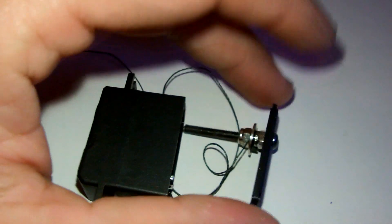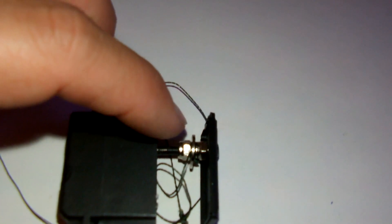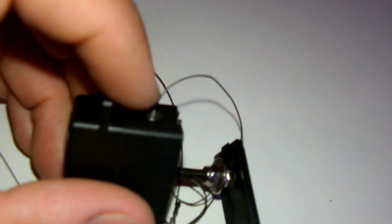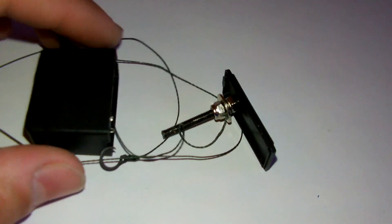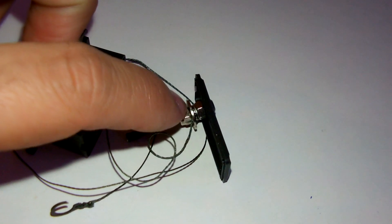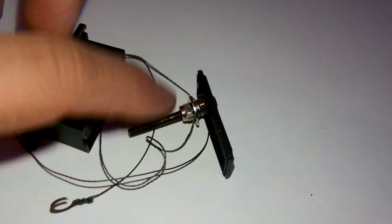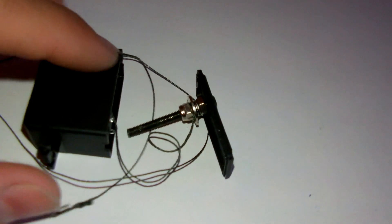The way this works is very simple — you just put that bolt in there and thread it all the way through the main gear. What you end up with is a closed servo where you'll only see that bolt on the outside, the ground-down gear, and the wire coming off from here. This bolt serves as your reel, and that's where the wire actually coils up. For the wire not to come loose, you sandwich the cable between the two lock nuts with super glue as well, so you can pull on it without it coming loose.